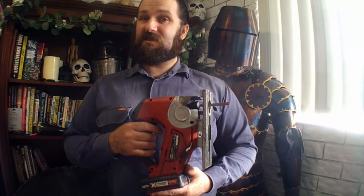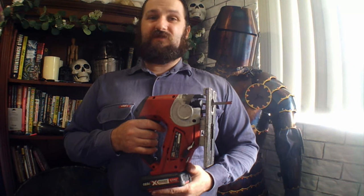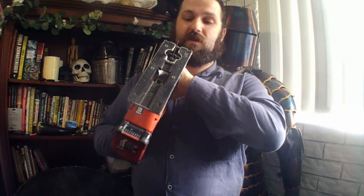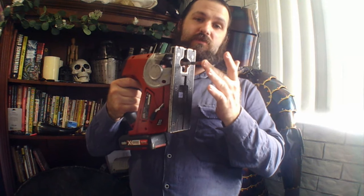I would definitely recommend against using angle grinders for cutting - it's really easy to mess up and wreck your piece of metal. They're also very dangerous, especially if you start doing curves. If you're trying to make a curved cut with a thin cutoff disc, you're putting lateral tension on the disc and there's a real chance of it exploding and flying everywhere. Angle grinders probably kill more people than any other power tool. Quick note: lubricate your bits when you're cutting steel - it'll put less strain on the motor and help save and extend the life of your saw blades. WD-40 goes a long way.